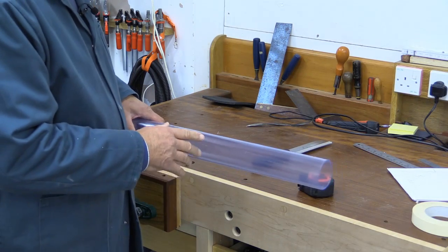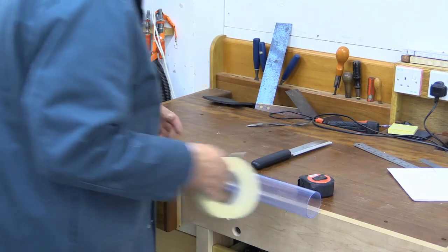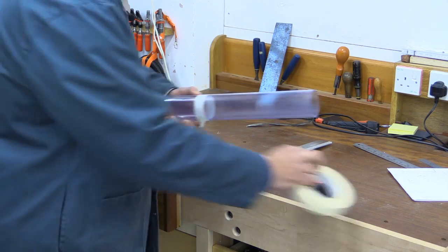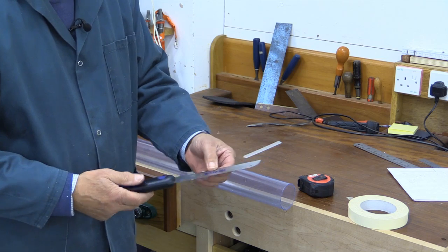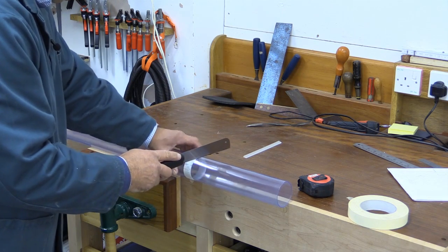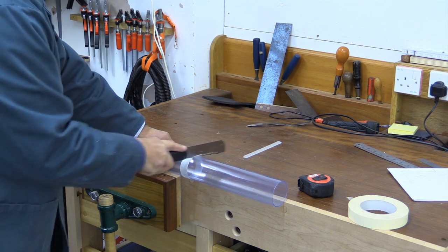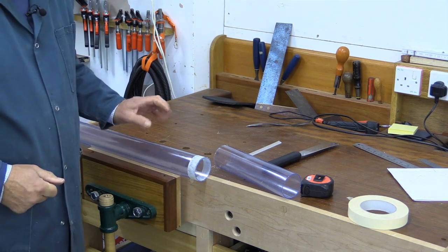Now when it comes to cutting the tubing to length, obviously mark it first and then you could take it to your mitre saw or any other power saw as long as you are careful. But I'm going to cut this by hand just to show you how easy it is. To get a nice straight line I just put a piece of masking tape around the pipe, and that gives me a nice line to follow. I'm using one of these cheap and cheerful Japanese style saws from a DIY superstore. The trick is to have your vice open just a little bit and rotate the pipe very slowly as you cut, then just clean up with a bit of sandpaper and remove the tape.